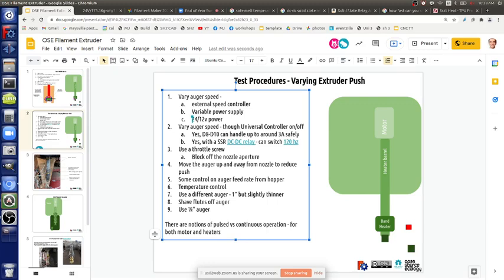That's the idea. And the actual extruders, the professional ones, the extruder action, all that force of friction, is actually producing significant heat. The auger itself creates heat? They're high pressure, yeah. Even the one you see on Precious Plastic, they've got this big motor that's way geared down to drive their auger. What you need for things like injection molding is that force. We don't need it here. But yes, friction is real.